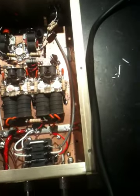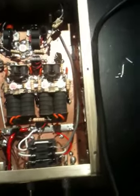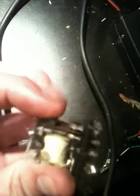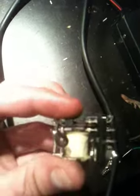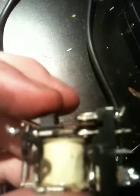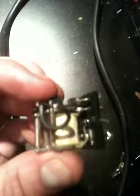The good news is we got her up and running, she's back to life and ready to rock and roll. What we ended up doing is we took the old school relay out of it. Some technicians will actually take the plastic covering off of the relay, and what happens is you get the fan blowing in all the grit, dirt, and grime in between the contact points. Over time you slowly start to lose your receive and you start noticing you have to rattle — you think you have a bad jumper somewhere, when all in all it's just the relay.